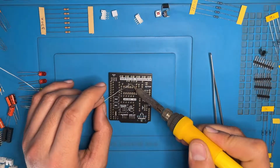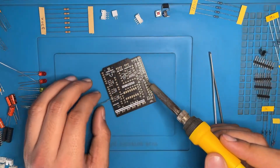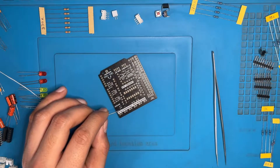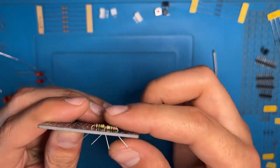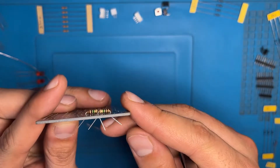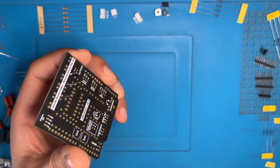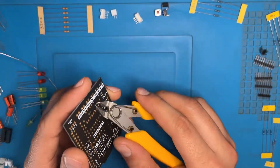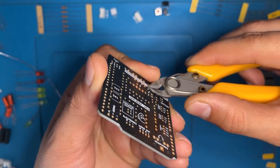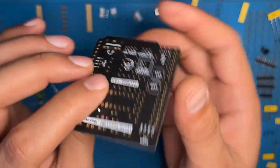After soldering, you can see that there is no gap between the resistor and the PCB — my tweezer is also not able to enter from it. This is how proper soldering should be done. After this, pull the pins inside and, taking the cutter in the other hand, carefully cut the extra pins from your PCB. Place your clipper on the base of the PCB and cut the extra pins carefully — it is so neat and clean. Do the same for R1.